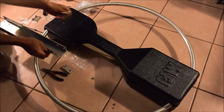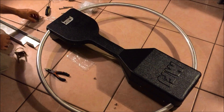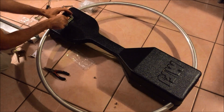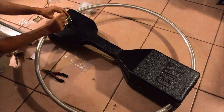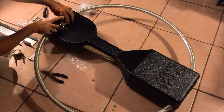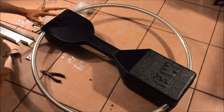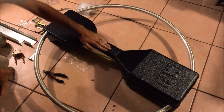If you want to mount it vertically, no problem. The four bolts you took out — you'll use these two plates and the longer two-and-a-half-inch bolts. Put the flat plate down, then the toothed plate where the mast goes in, put the other one on, and run the bolts in. Slide the mast in and it's mounted vertically. That's how you mount it vertically standing up, or horizontally with the mast going sideways — the manual just gives a picture.